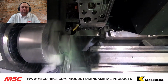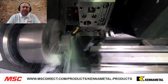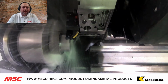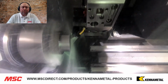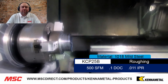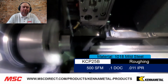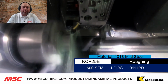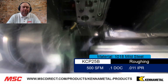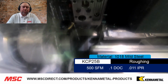So let's just say your supervisor brings you a piece of stock and says, hey, I need you to turn this down to, say, 3.5-inch diameter, 2-inch length of cut, and you go to the tool crib and you grab just the standard general purpose Kennametal KCP25B. And right there's your parameters. You put it into some pretty safe running parameters at 500 surface feet, 100 thou depth of cut, and 11 thou per rev. And you're going to get the job done. Your supervisor is going to be happy that you got the job done, but it's going to take you a little longer than it probably should have running at these parameters.